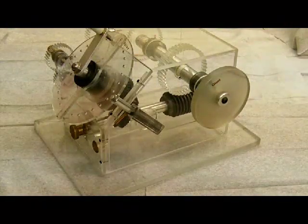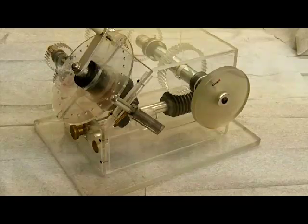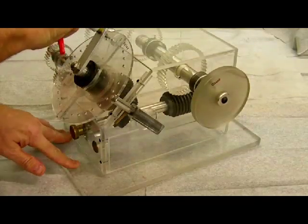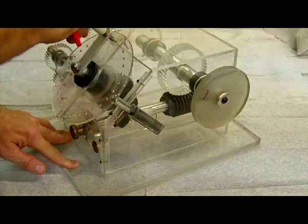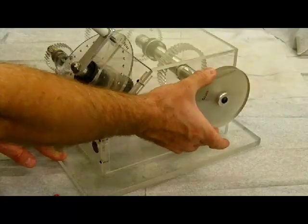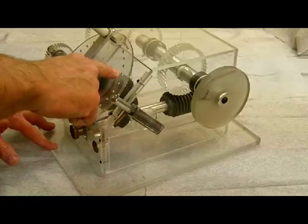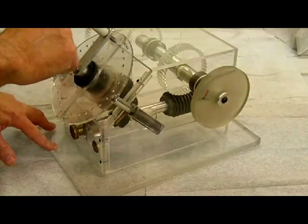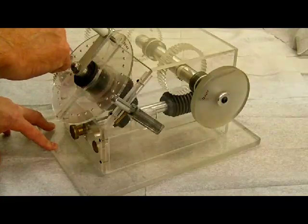This is a plastic model of a dividing head and its job is to divide a circle up into even parts. It can be used several different ways. If I turn the crank on the back, it's called simple or plain indexing. If I rotate the spindle, it can do what's called direct indexing. I can also use the crank handle to do angular indexing or differential indexing.